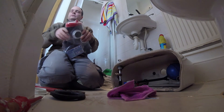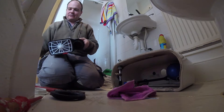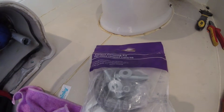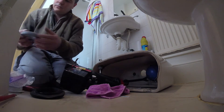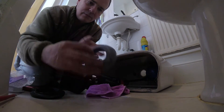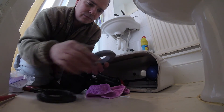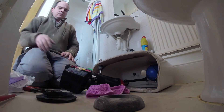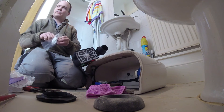The new one is very similar in that it's the same height and will fit into the cistern. Make sure that when you get one it's the same height - they come in different heights. That's the new washer - you can see it's a big difference from the old one. The old one's been pretty squashed into shape, and that's why you can never get them to seal again when you try and reuse them. A new one's the way to go.